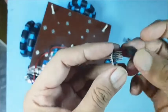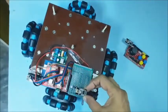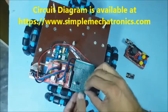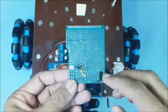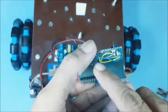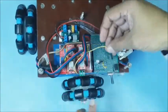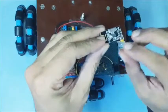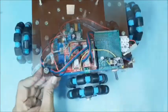Then use a two-row 8-pin berg strip for the nRF24L01 and plan to position it suitably on the PCB. Both nRF24L01 modules are paired for wireless communication, and the berg strip pins are soldered on the PCB as per the circuit diagram. Since the nRF24L01 requires 3.3 volts power supply, an external pin is soldered for VCC. Now match and insert the PCB in its position on the Arduino Mega carefully, then connect 3.3 volts from the Arduino board to the PCB for the nRF24L01. Soldering a 0.1 microfarad capacitor across the nRF24L01 power supply pins improves signal reception. Then insert the nRF24L01 in its position carefully as planned.